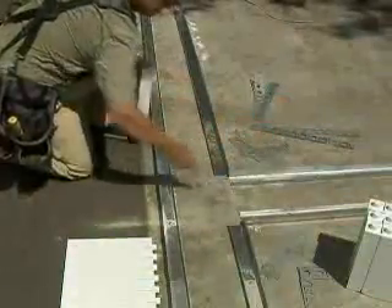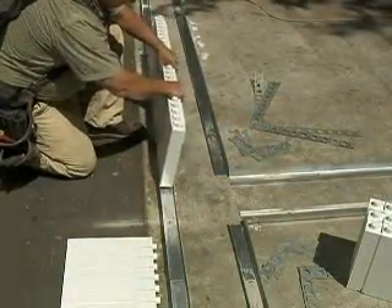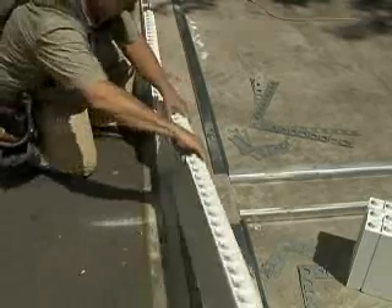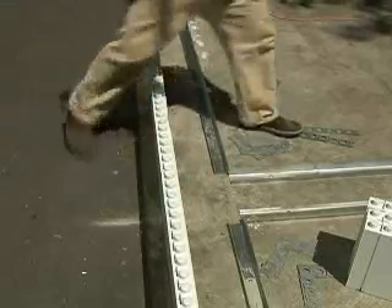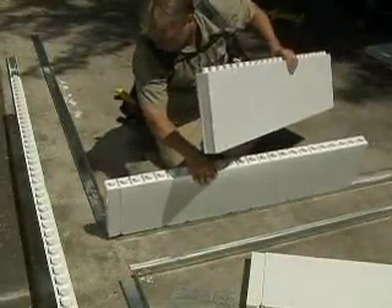Where perpendicular walls meet, they form a T-wall intersection. As with 90-degree corners, T-walls should be constructed first. Use a full four-foot panel to form the back of the T-wall. Avoid placing the joint in line with the T where higher concrete pressures exist. Align the joint with the outside of the T-wall leg.